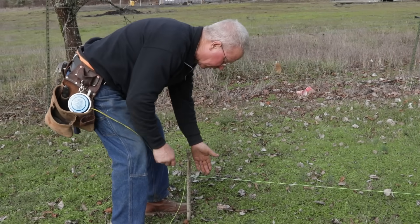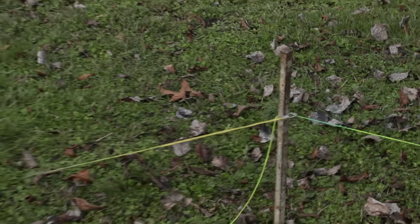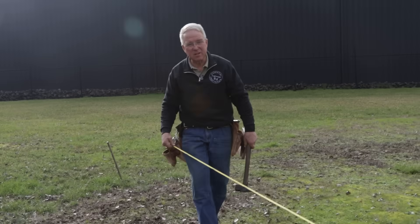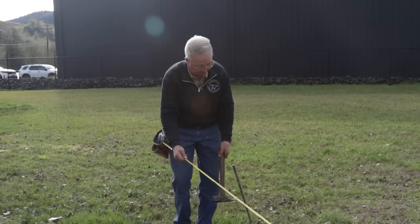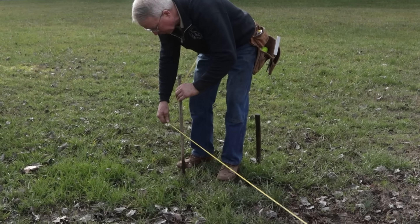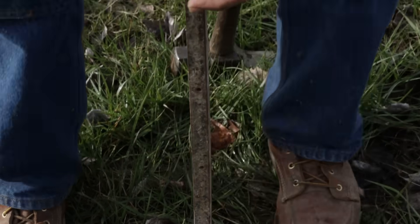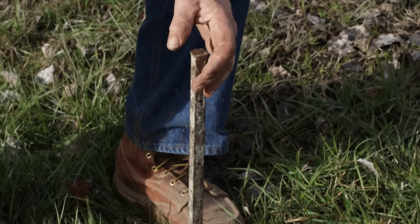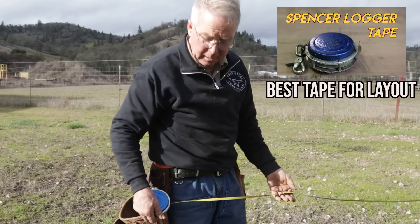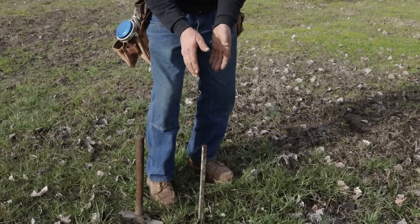Rough. The string on the outside of the stake enables me to hook my tape directly on the string, directly adjacent to the stake, and pull with minimum deflection. Now I'm just guessing it's square — it doesn't make any difference at all at this point. No difference. I'm going to come 36 feet and put the stake inside the 36 feet, so the 36 is at the outside edge of the stake. This is a Spencer automatic rewind tape — we've got a video about this. It sure beats cranking it. It'll make a hero out of you. So this is close to 36 feet.